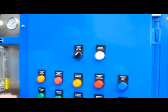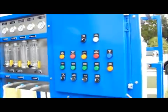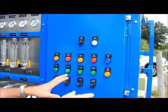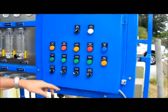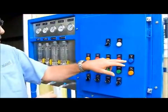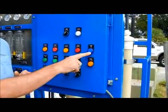The system main power is just your main on-off switch. When you're not going to use the system, you can turn it off. Anytime you want to run the system, whether manual or automatic, you have to turn this on and the power light will be on. You have two fault lights here — if your pump starts drawing too much current, one of these will trip and you'll have to reset the system. You also have indicator lights for your tanks: if your raw water tank is too low, we don't want to run this pump dry, so it'll stop automatically. If your filtrate tank gets too low, same thing — we don't want to run the backwash pump dry. And if the system is in automatic mode and it stops because the tank is full, this light will turn on so you know why the system stopped.